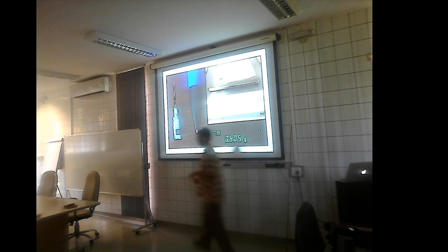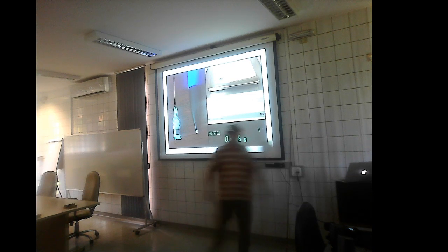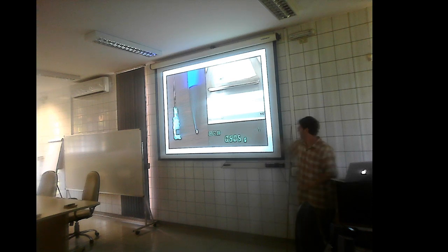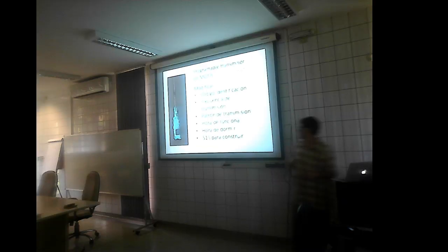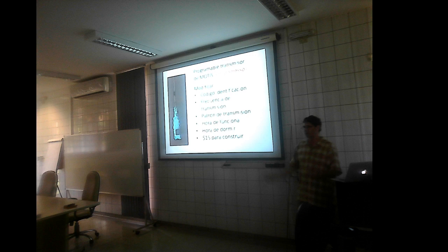It's programmable, and it has a clock, so you can tell it, don't transmit at night, because I don't care about those data. It'll save a lot of battery power if you do that. You could program it to wait a month and then start transmitting. If you know where the bird is for the first month, you don't need to waste your battery on those data. So you can probably get a lot more mileage out of a programmable tag, as opposed to the tags that are available now, which as soon as you turn them on, just start beeping and draining the battery. And we've got them to weigh an appropriate amount for most of the small birds. Like I was saying, you can program them to do whatever you want, and when you want them to function, when you want them to sleep. And we think we can build them for about $15 as opposed to $150.